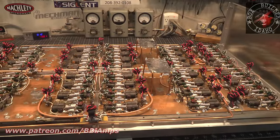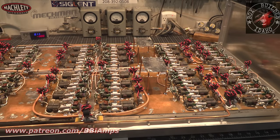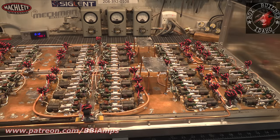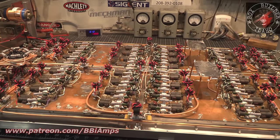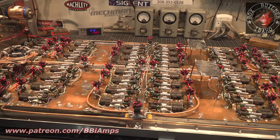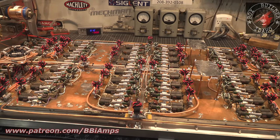I could have stayed with the 5-to-1s, but I would have had to drop 16 transistors out of the equation to make it work. Once you think about that, every layer of combination and splitting has a dB gain loss. Now you can make that back up by adding capacitance on the other side of the combiner and get it back, but still there's a little bit of loss.